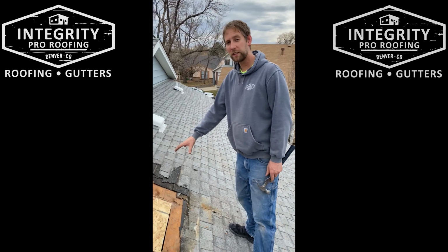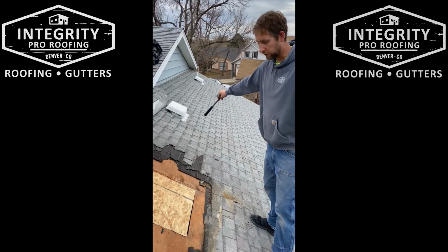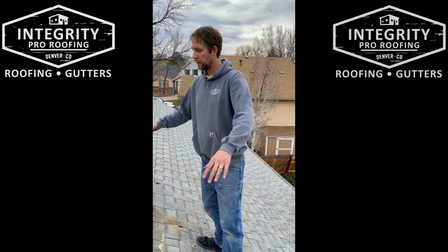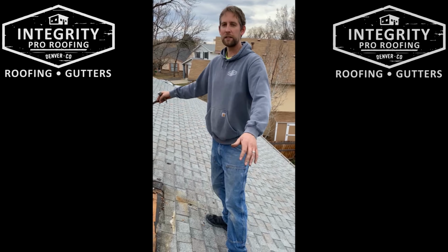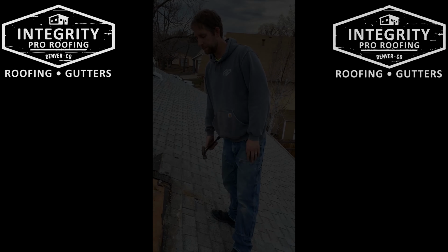All right, we've got our hole filled now. Decking is in. Now, normally when you do this, you don't have to remove the whole area, but for this, the swamp cooler was so rusted out and leaking, all the shingles are completely degranulated and starting to fail in this area. So we're gonna tear off a larger area, but normally you wouldn't have to do this, but you'll see how we do it.